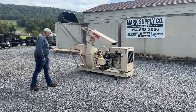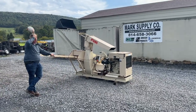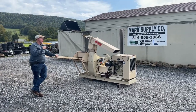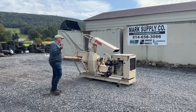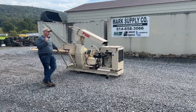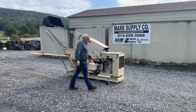We used to do a ton of straw blowers. The problem is you can't find them anymore. They've updated these to a three-cylinder Yanmar with a DPF burner on them and they're not the same. In my opinion, this is a non-emissions four-cylinder Kubota V1505. Be very careful out there right now — there are some guys advertising straw blowers that aren't telling the truth. They are the old Finn straw blower that had the Kubota V1703 or V1702 on it, and how you tell the difference is the style of the radiator.